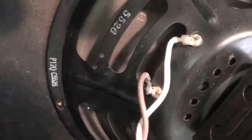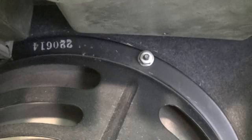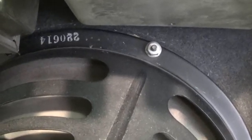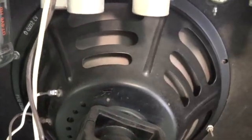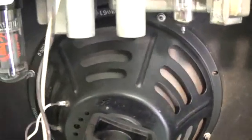Now let's start taking a closer look. We've got a speaker — it's an Alnico P12Q speaker, so it's going to be a Jensen. The date code reads 220 Jensen, a 6-14, which would be '66 or '76. Since I believe this is a '74 amp, it would appear that this speaker might have been changed. I've got to say though, if they did change it, they did a really nice job, because there are no flies on a Jensen P12Q. It needs its little sticker to make it look official — you can get perfect reproductions, which I probably will do. I see no damage to the speaker cone, but that doesn't always mean much, so I'm going to withhold judgment on this speaker until I actually get it out and take a look.